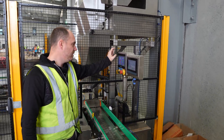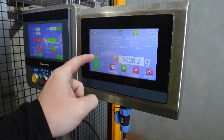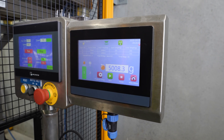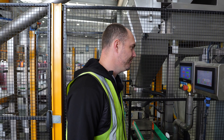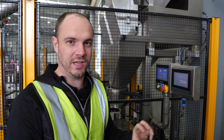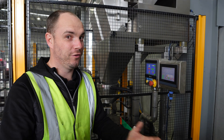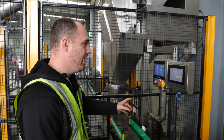Here are our screens. So far this morning, the guys have made 72 buckets of Trojan. Orange means that the left hopper or left scale is ready to dump, and the right side is completely off. You can see there's 5,008 grams in that hopper, and we've got another scale behind me that we test a bucket on every now and then just to make sure it's all good. All the controls for this area are right here — it's very, very finicky. You change things by one or two percent and it's the difference between 5,008 grams and 5,200 grams. Over 1,160 buckets, if each bucket gets 200 grams more, that's good for you guys at home but not so good for us — it means we're many buckets short from our total from a bulk bag.